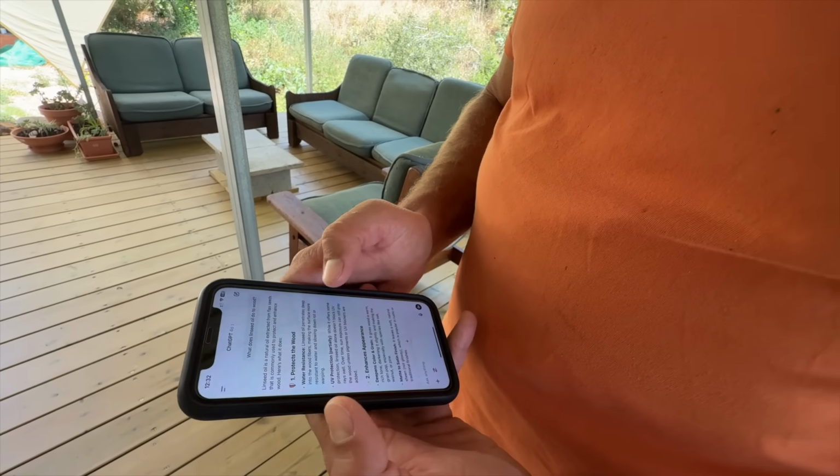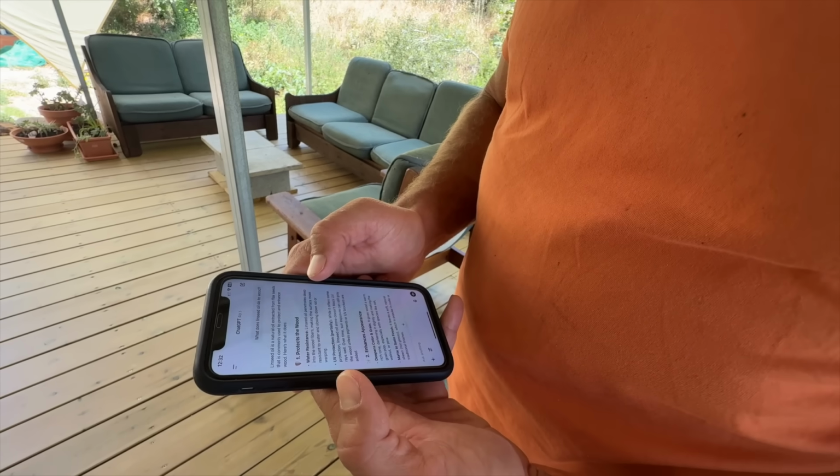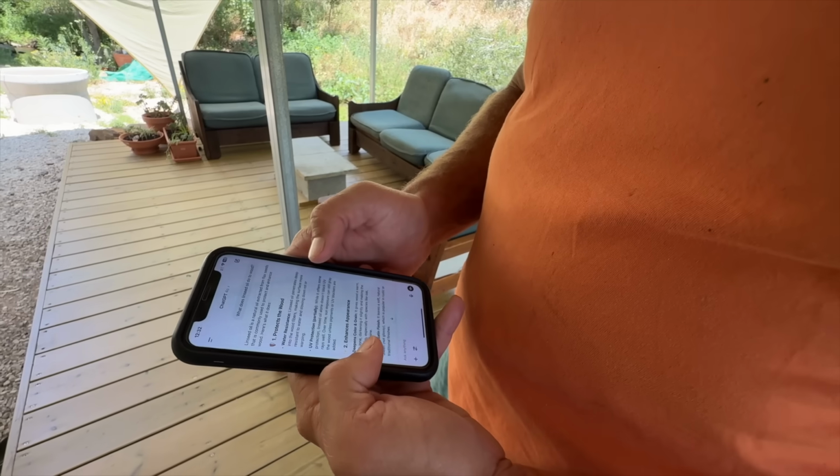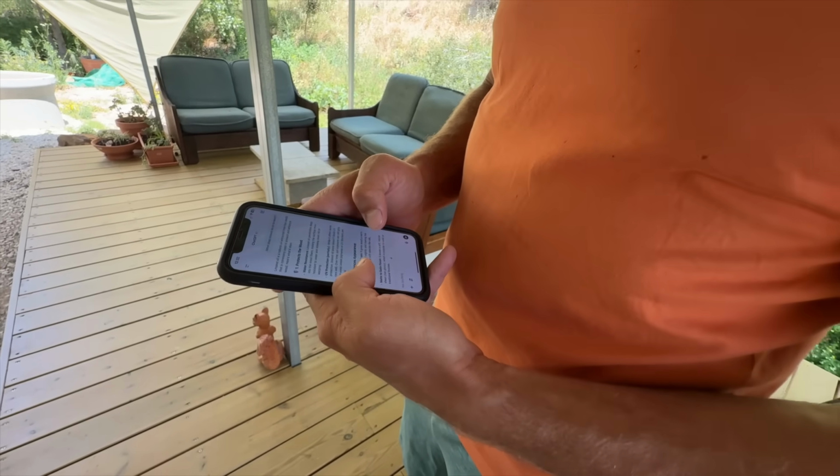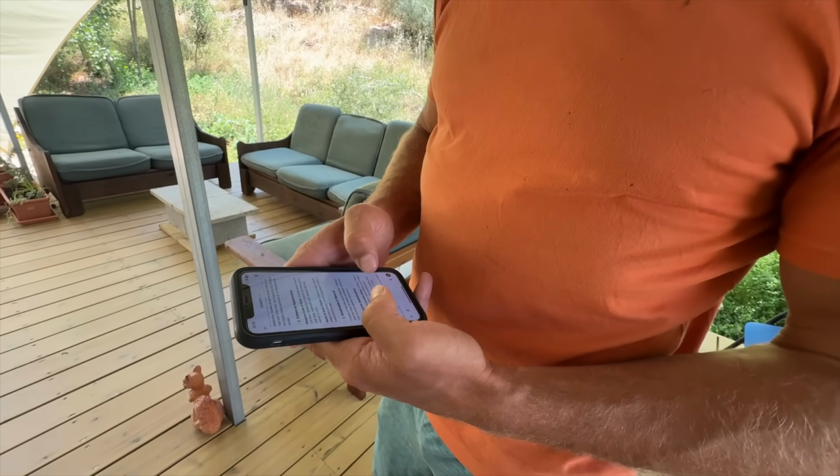It's a natural oil extracted from flax seeds that is commonly used to protect and enhance wood. It penetrates deep into the wood fibers, making the surface more resistant to water and slowing down rot or warping. It enhances the appearance of the wood, the color, the grain, especially where I've sanded, and you can really see the fine, beautiful, almost feather texture to it. Or waves. I like that, waves. Waves up here in the mountain. It leaves a soft, natural sheen, not a glassy appearance. It's popular for rustic and traditional finishes, just like we want in our mill.